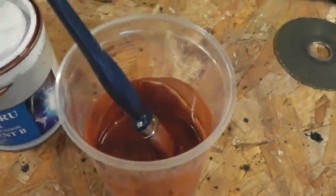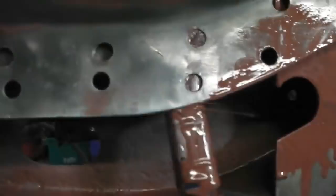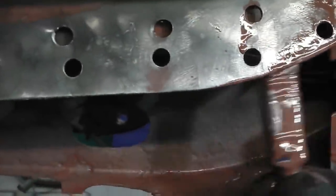It is good stuff. It's very thin, but I think that's the idea. So in it goes behind all the seams. And the idea will be that the weld will burst through it. Although I'm not sure if we should clean each plug hole up so that the welder gets an instant arc. I don't know how effective it is to push through this. I mean, it's a zinc, I'm taking it's a zinc or it's a metallic component to the primer, which would help to conduct the arc. However, I think I would be rather cleaning up each plug weld. Round we go again.